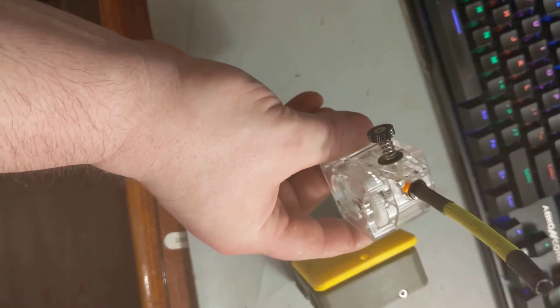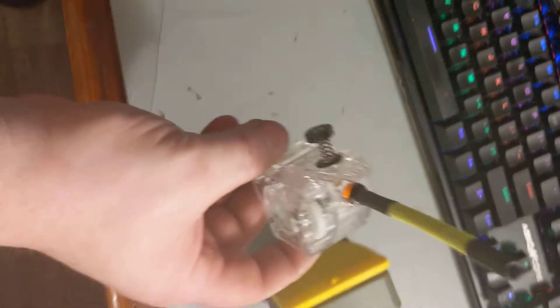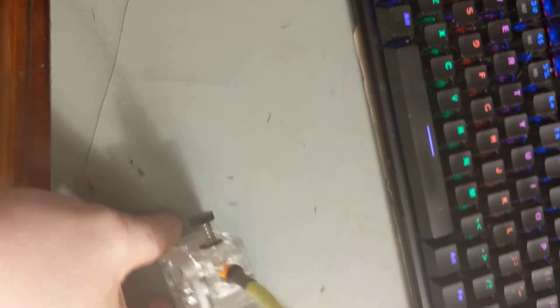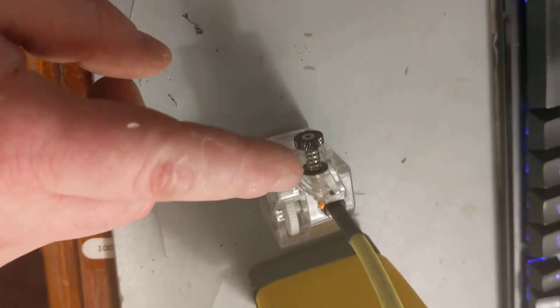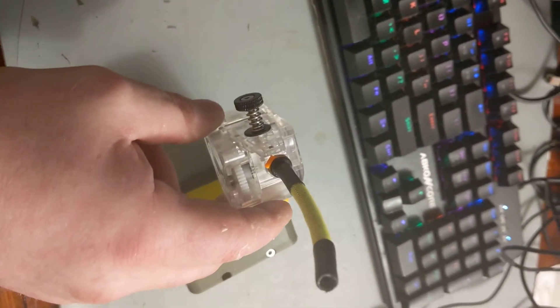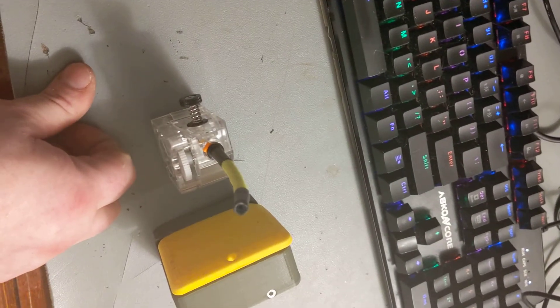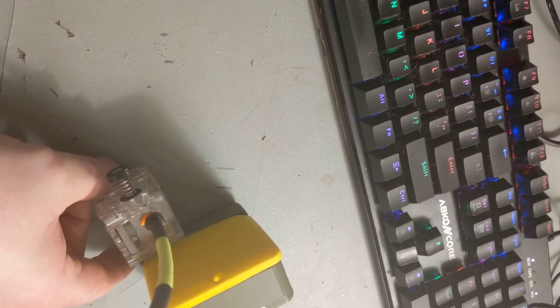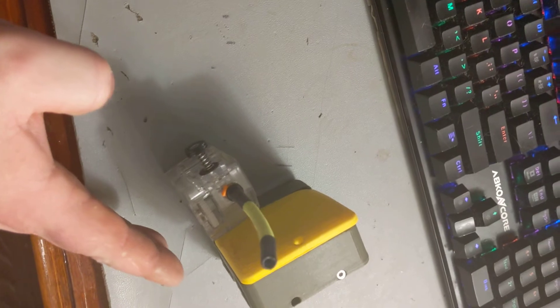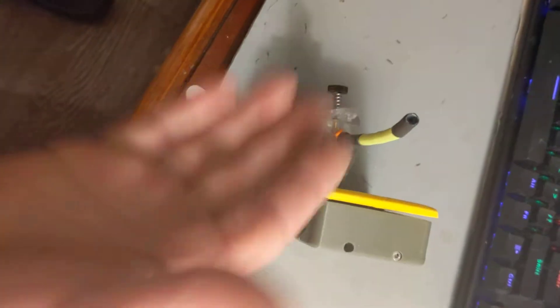There's going to be one right here and one that's mirrored on the opposite side — basically a left hand here and a right hand here — both in an effort to have this little lever tab stick out so you can access the innards to clear a clog or make sure your gears are in line. Those will go right here like that, and then the stepper motor will bolt in right here, very close to the rod, which keeps it from bouncing and resonating so much.